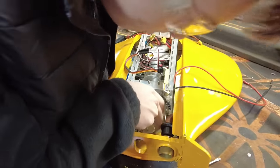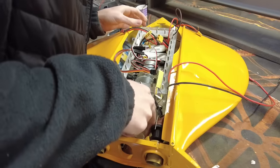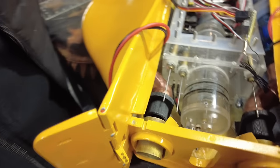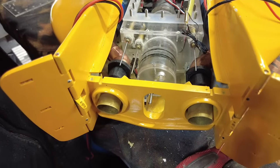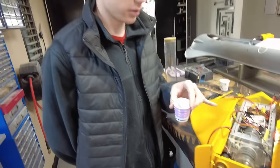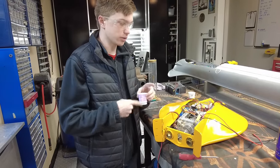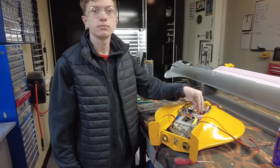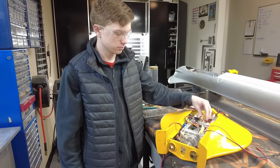It's looking promising — oh, hell yeah! Just got to go down and back another inch. We've got about three-sixteenths of an inch on one side and a quarter inch on the other. I think all that's left now, at least in terms of testing, is reinstalling the top and installing the linkages. Then we can do a function test. Once the function test is done, we have to do the add-ons such as quick battery access — and we can do that separately because the lid is a separate piece, which is a good thing. We need to bolt down the bilge pumps before we forget so they don't slip backwards.